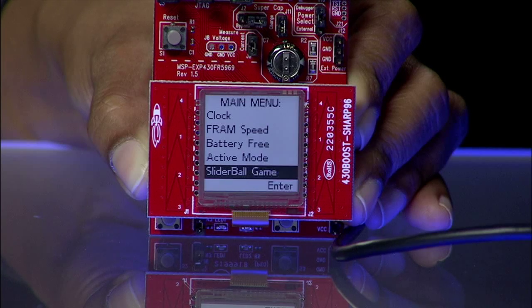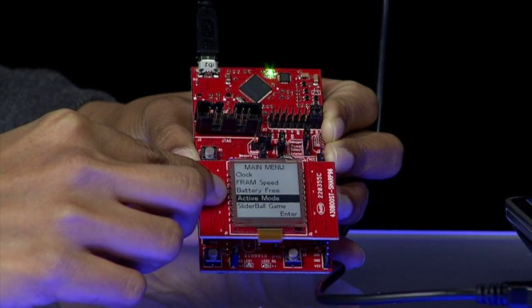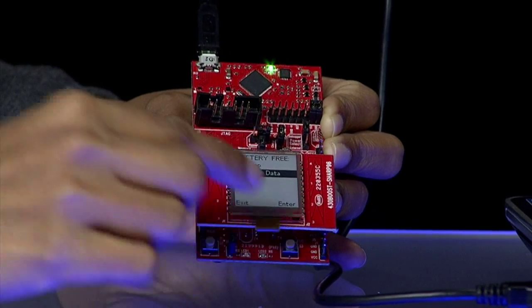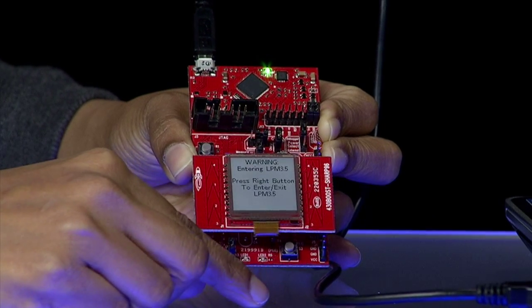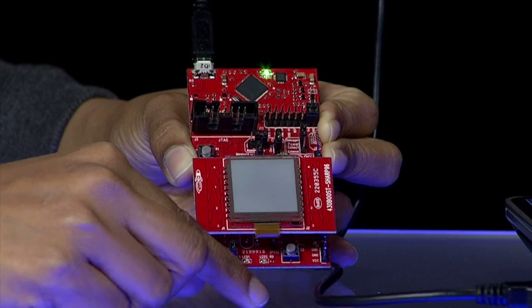The third mode is battery-free RTC. Before entering this mode, ensure that the supercap is efficiently charged by plugging in the board via USB and allowing a few minutes of charge time. Upon entering the mode, the board displays a warning screen letting the user know that the display is about to be turned off. This is done to maximize power saving in LPM 3.5 or RTC mode.